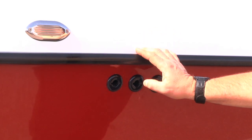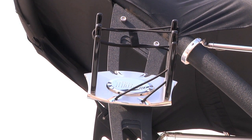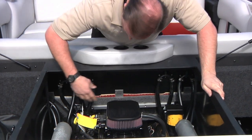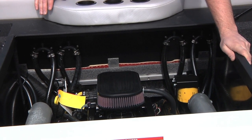A wakeboard rack is another obvious indicator of potential ballast tanks, as wakeboarders want a boat that's weighted down to throw a big wake for jumps and aerials. Looking in the engine compartment, there's specialized plumbing showing how water comes up into these tanks — these tanks are not always obvious when you're looking. When you look down at the bilge area, extra piping such as four sets of tubes and elbow joints is a good indicator that there are extra ballast tanks inside the watercraft.